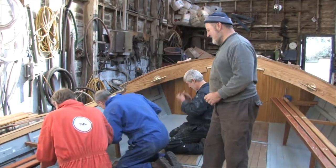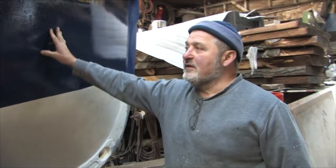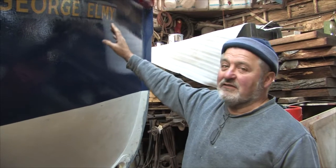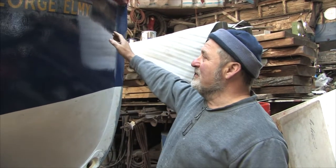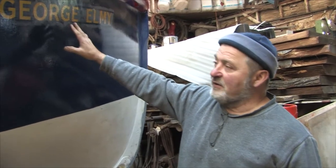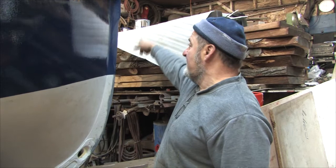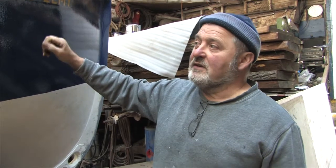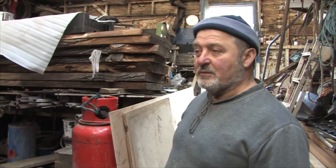They're doing a very nice job. We've now had our final coats of paint on here — that's another flat and two coats of gloss — so there are now several coats of paint on the job. This has been prepped up by the sign writer and we've actually got a name on now. As I said, doesn't matter what work you do, the sign writer comes in and pinches all the glory — doing a lovely job of that. It's just a little bit tacky there now because he's ready to put the actual gold leaf on the job, so it's not quite finished yet. The gold leaf is to go on, then the RNLI flag will go on the front, and the same name will be on the other side. There's 'lifeboat' on both sides of the boat — when that's all nicely done, that really sets it off with the gold leaf.